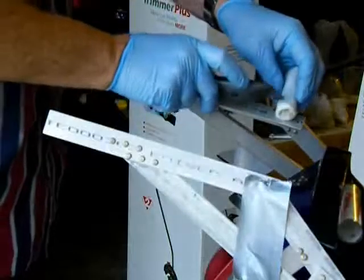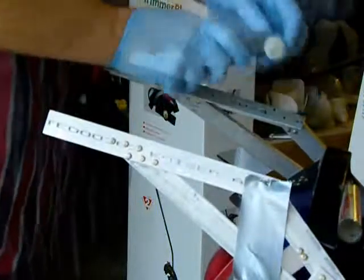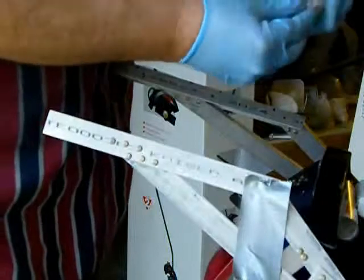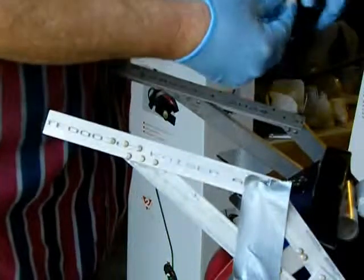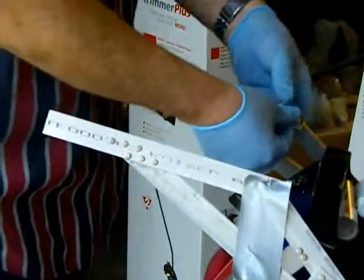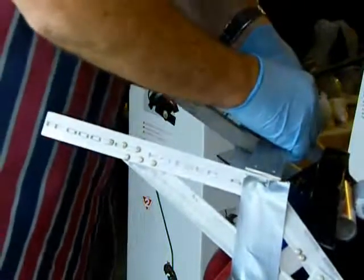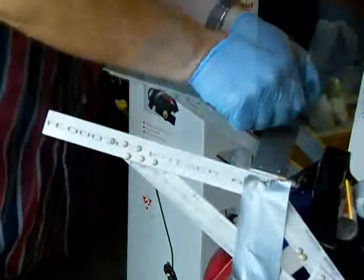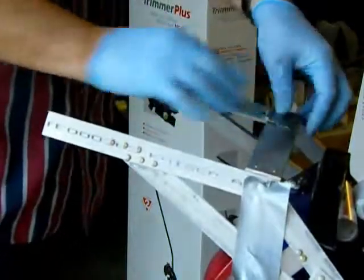I cut the roll into 6 evenly sized chunks and used one chunk for each end of the top plates. I sprayed a little WD-40 on the top plates so that they didn't stick to the Quick Steel, but I was careful not to contaminate the Quick Steel with WD-40 and ruin it. I put the Quick Steel on the top rail and then squished it with the top plate and held it in place with some duct tape. If any Quick Steel squeezed out where it didn't belong, I just pushed it back in. After a few hours, the Quick Steel hardened solid.